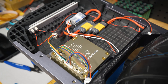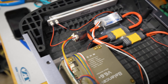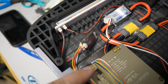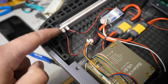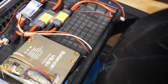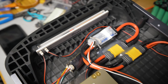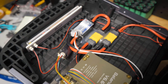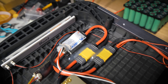This is not exactly a tip but something to be mindful of when connecting things. You have a daisy chain of power going from the Bluetooth module to the light bars in the front and the back. The way it runs: you have a UART port running to the Bluetooth module, and the Bluetooth module outputs power to the front light bar, then that wire travels to the rear light bar — essentially voltage going from one to the other in a daisy chain. Be mindful that when plugging each of these in, I've noticed — and I don't know if this is the case for all kits or just an early batch — the red and black wires seem to be reversed.